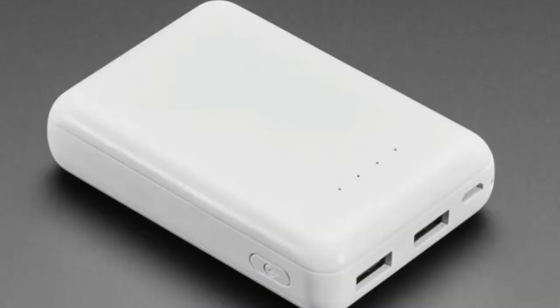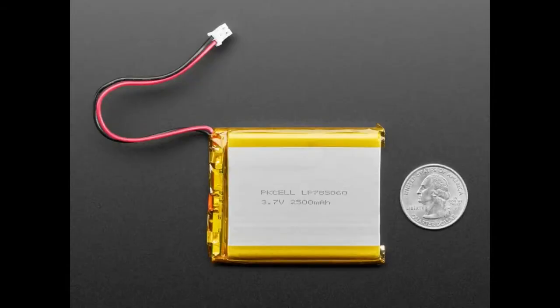But there are other devices that could benefit from this. Here's a USB power pack — probably everyone has one. This is a pretty chunky one with three ports: two USB-A outputs and one micro USB input. You can charge this pack, but it takes a couple hours because you can only draw maybe an amp from the five-volt power supply to charge the 6,000 or 8,000 milliamp-hour battery inside. And then you can supply two five-volt, one or two amp outputs. A lot of devices these days have very large built-in lithium-ion, lithium-polymer, lithium-cobalt batteries, and once you get to 2,000 milliamp-hours or larger, it's very hard to charge them over a five-volt power supply.